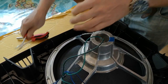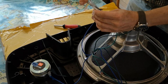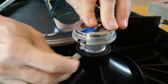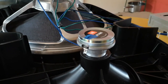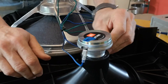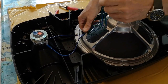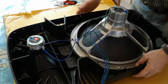Check the HF drive unit connections — again very loose. You can't get them on the wrong way around because there's a large one and a small one, a six millimetre and an eight millimetre width crimp. Squeeze those with pliers until they're really tight. Now the speaker loom is attached. There is a tie wrap somewhere — it seems to be randomly placed — which holds the cables to stop them vibrating loose, so that should be in position.